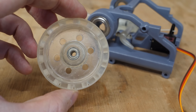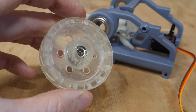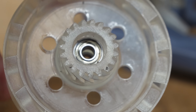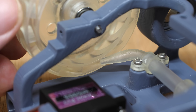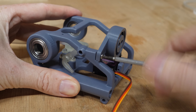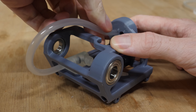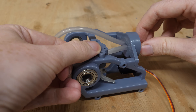This turbine design is almost identical to the ones tested earlier, but it has a gear to drive the rear wheels. The only issue is I think I broke a bearing whilst pressing it into the hub, so I'll need to change the design later — but at least it mounts in the chassis and aligns well with the nozzle. I then attached a mount to hold a drinks bottle as the pressure chamber, which can be plumbed into the throttle with some flexible tubing, as well as a one-way valve for filling the bottle with compressed air using a bike pump.